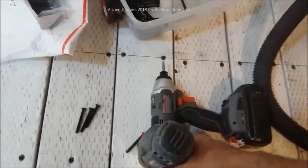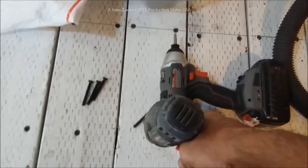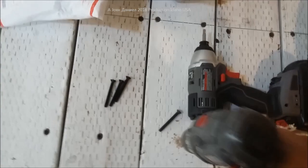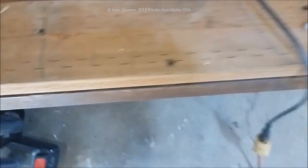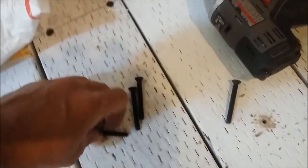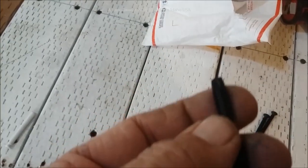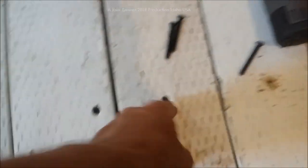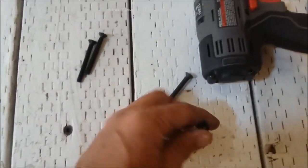I'm going down into the metal frame underneath. Now that's down through the metal frame, so you'll be able to see the screws coming through the angle right there. These are machine-tip screws — bolts, whatever you want to call them — that have a special serrated tip to start threading into the metal you're going to use them on.